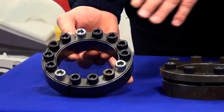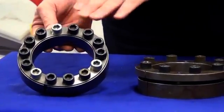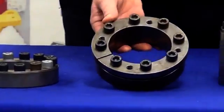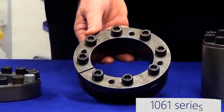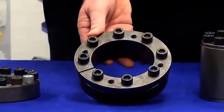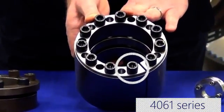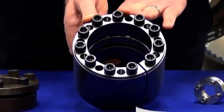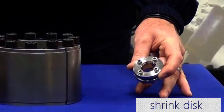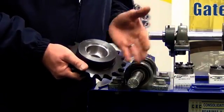The first is the classic, the 2005 series, which is the first design. That's regarded as a medium to heavy torque capacity. The second one is the 1061 series, which is also a medium to heavy capacity. The third one is the 4061, which is a heavy duty, medium to heavy duty torque. And last but not least we have what we call a shrink disc for locking a hollow bore down onto a shaft.